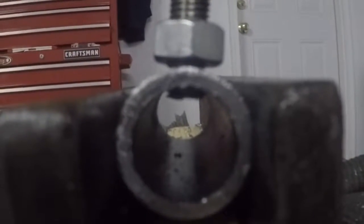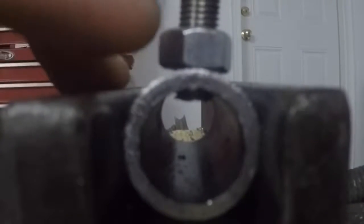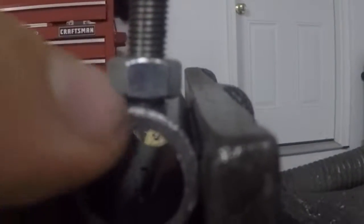Okay. So once you put the rod through there, and I had the right stick out inside of there, I'll just take this nut and lock this nut down. Now this nut will essentially double nut itself. So you have a top nut here, this is threaded, so you're almost double nutting these two together, which will cause this rod to never move anywhere. So you're not going to need to Loctite it in there or anything like that.